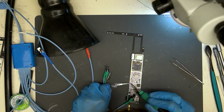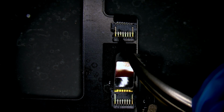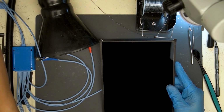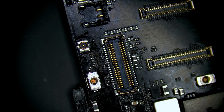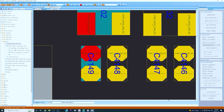Okay, and we're back. Hook up to DC power supply and prompt to boot. Now we get what looks like a normal boot sequence. Let's grab an LCD and see if we can get to the operating system. No image. Checking under the scope, it appears our friend at the other shop accidentally knocked some components next to the LCD connector. Let's go ahead and fix that real quick.